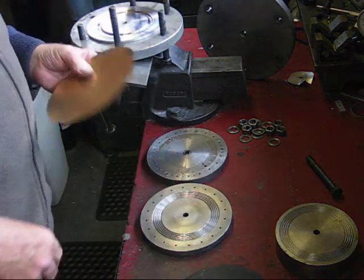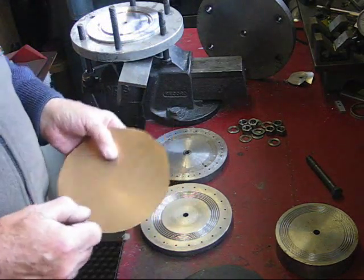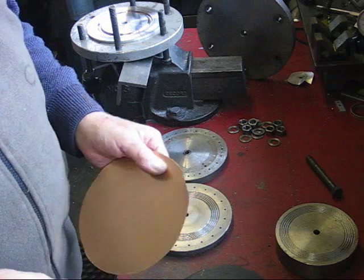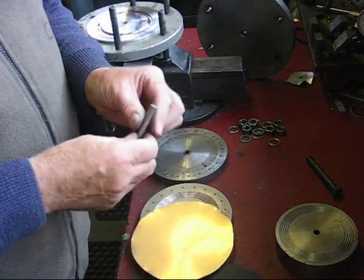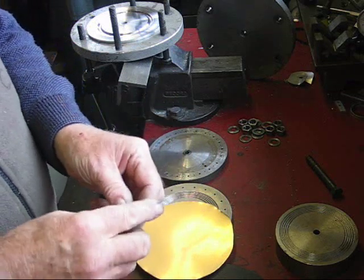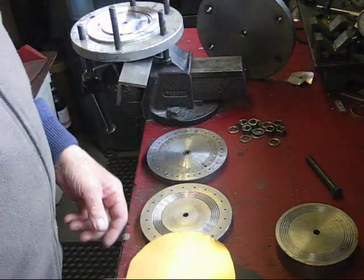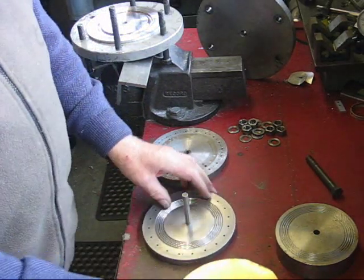Concentricity is very important for the TMJ — everything has to be concentric. So the first thing is to make a nice accurate hole. I'm no good using a drill in my opinion; drills don't cut round holes. So I use a punch. All I use here is a piece of high speed tool bit which I grind up in the grinder so it's slightly concave at the end, so you get a nice shearing action. I'll show you what I do.